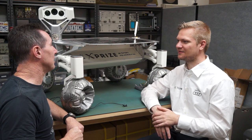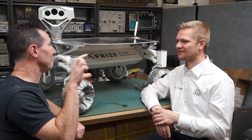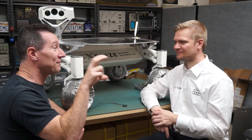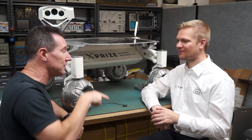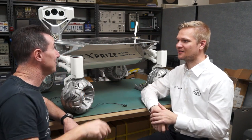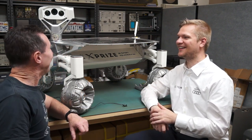Bypassing is a pain in the ass, because when you've switched off your power, if you've got a lot of bypassing there's a lot of energy stored in those caps. They can still continue to dump the energy. But where do you put these chips? Do you put them after the bypassing? Yeah, definitely.